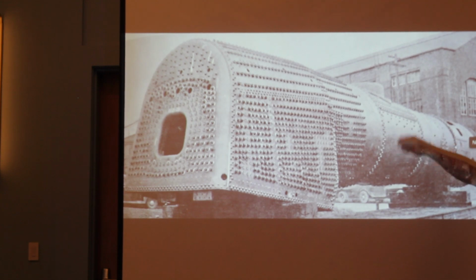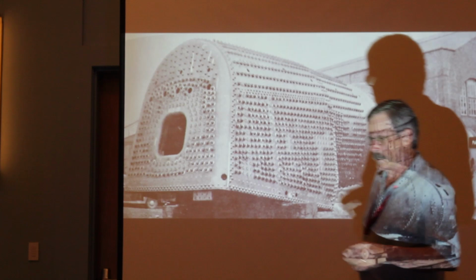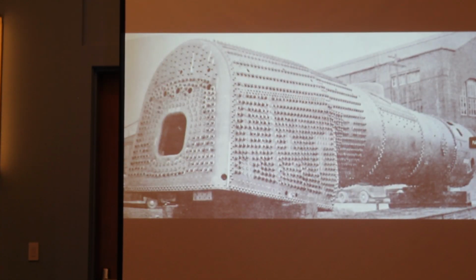If this joint up here, that's a longitudinal riveted joint, is keeping this all one piece the whole way around here, and it's held together there with the rivets. If that joint fails, unlike your firebox, it's going to open up. And then you and anybody in the cab will be picked up here, picked up there, picked up there. You won't be around to be interviewed about what happened. It will destroy itself and you along with it. So the Interstate Commerce Commission was very, very fussy about how boilers were constructed.